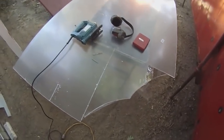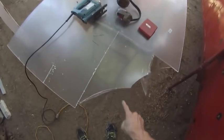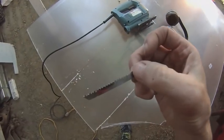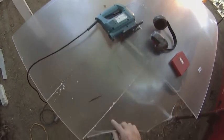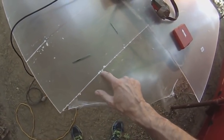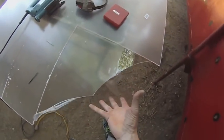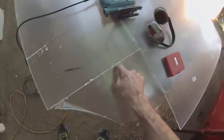This is my first time working with acrylic, also known as plexiglass. I made a cut with this blade at speed number six, which is top speed, and it filled in behind the blade. I thought that's not a big deal — I can just crack it off. But the piece cracked here instead of along the line that I had cut.